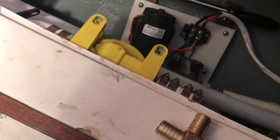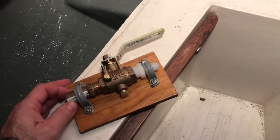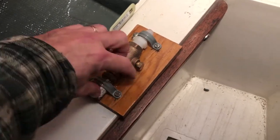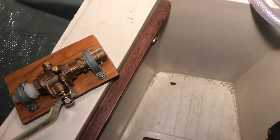Another consideration: once I tap into this line here — which is just past the valve for the toilet — I'm thinking I should add another valve, because if I ever have a leak in the pump I could just shut the pump off and leave the valve open for the toilet so it can still be used. I bought a new valve assembly; I still need a bronze piece here so I just put this plastic one in temporarily. One side is three-quarter hose, the other side leading to the pump is half inch.